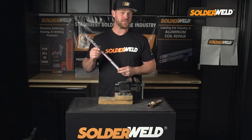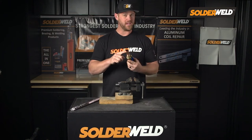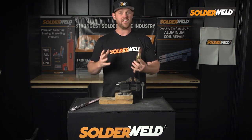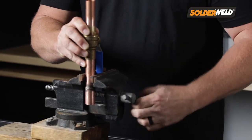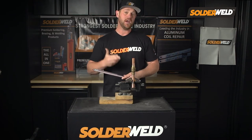What I have here is a 56% silver solder — 56% silver with an external coated flux. This is really good for dissimilar metals. You can do copper to stainless, copper to copper, even copper to brass, as I have here, and that's what I'm going to demonstrate today. I've got a brass valve and I'm going to be bonding it to copper — the same situation when you're out in the field with a TXV, ball valve, isolation valve, anything like that. With this 56% rod, since it has the flux on the outside, I don't need an alternative flux — I can go straight to heating it up and applying.